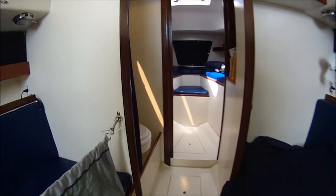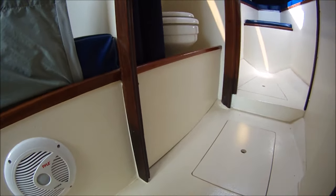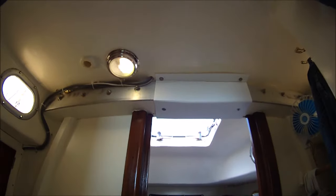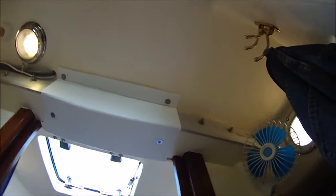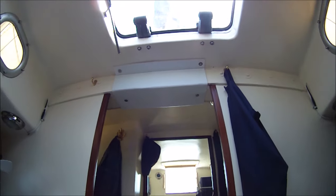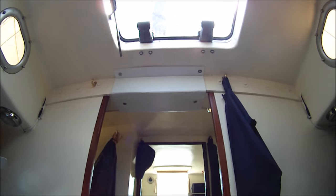The depth transducer — instead of drilling a hole through the boat or mounting a reservoir inside, underneath this panel under the head is a transducer we just epoxied to the inside of the hull, and that works well. And the mast beam is reinforced with this aluminum plate beam, one on each side of the original wooden beam. This is an early model Alberg 30 that tended to have sagging or cracked wooden mast beams over time — on later models they already put an aluminum beam inside underneath the liner.